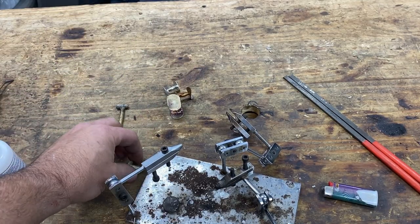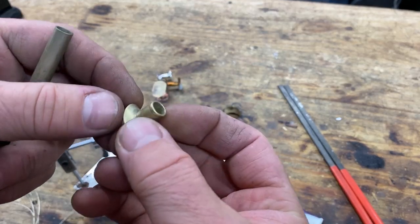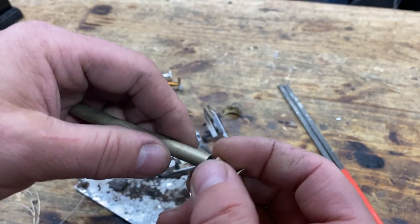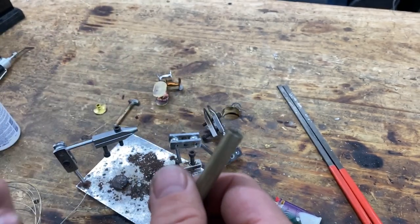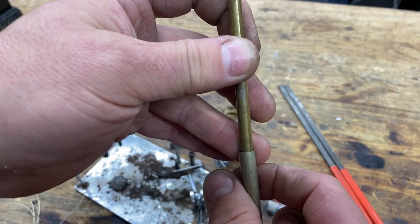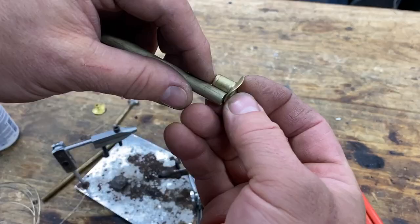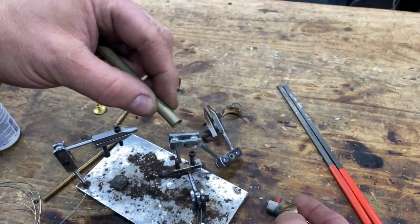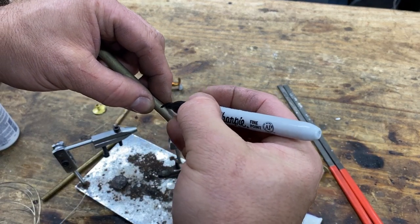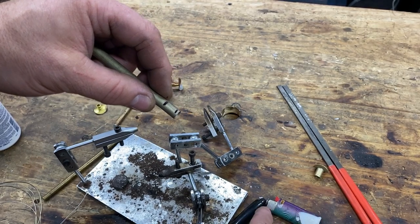You've made a tool. What about a socket and a flange? So if we want to make something like this, we get a piece of tube stock. I like to build mine with quarter-inch rods so I have a heavy, stout connection — I can make it stronger than it was at the factory, it's going to last longer and be more durable. We're going to make a little decorative ring right there. Let's go to our bench motor — this time we're going to use a triangle file.